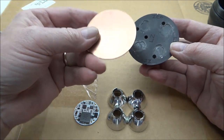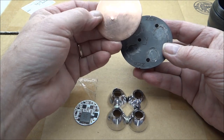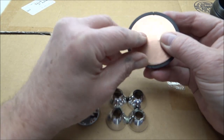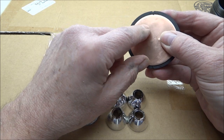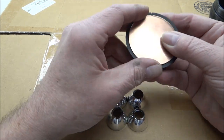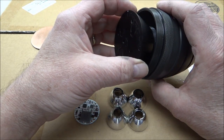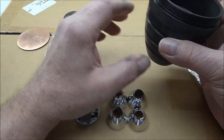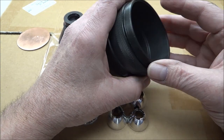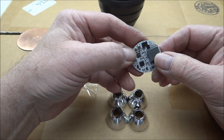I've taken a copper plate with discs on the bottom that fit right into that heat sink, so the four Cree LEDs will sit on this copper plate. I'll screw the copper plate down to the heat sink for decent thermal management. That screws right into the Five Mega head, which is really heavy, so it'll have good heat sinking. It will be attached to a 6D mag light body using five lithium-ion cells.